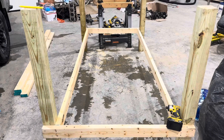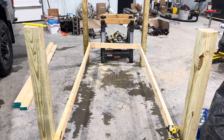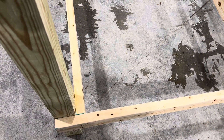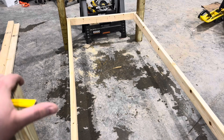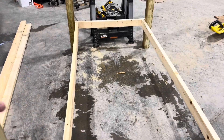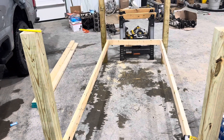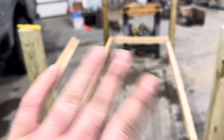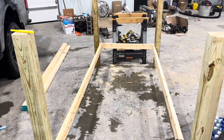There really aren't that many cuts with this — that's the beauty of it. You're cutting two 4x4s in half, which is technically four cuts because you want to true them up so the height is the same. You'll also cut notches out of the corners of the lower 4x4, ideally done with a circular saw — it's super slick. You might want some sawhorses or an additional flat surface. The whole reason I'm building this is I really don't have many flat surfaces right now.